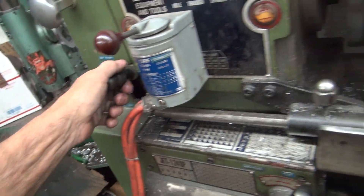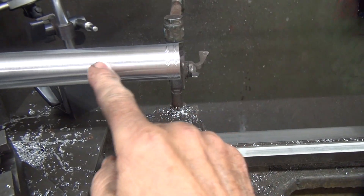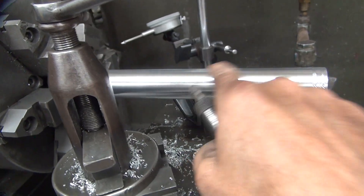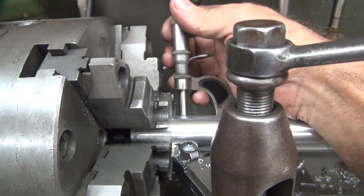Okay, turn it the other direction. A little chatter out here, definitely chattering out here. We have a little bit of a dip in the metal, and the two wings are the same within half a thou. So let's see what we got now.